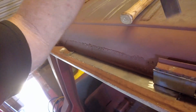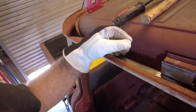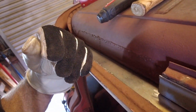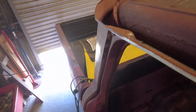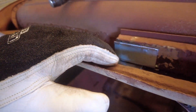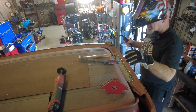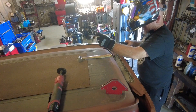I'm going to use my little spot weld chisel and push this down just a bit of tension on it. Everything will be nice and tight, braced the way it's supposed to be. It would bother me not to fix that even though no one would ever see it. I did my welds on the inside and the out - make it nice and strong so when I grind metal away it'll still be plenty strong. Getting this in here and then we're going to start on that back section.